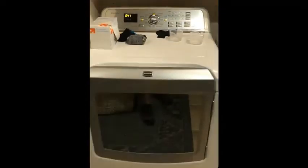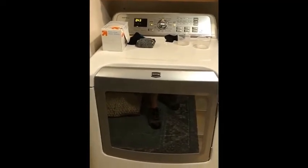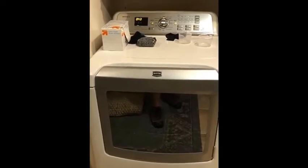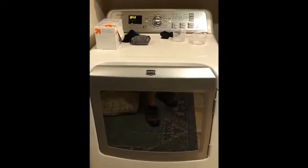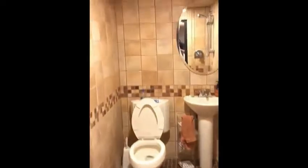Since windows and doors are closed, the question is where is that air coming in? Could running the dryer impact the operation of the water heater? Maybe — and that's what we're going to test for. I've turned on my dryer. Since we're doing what we call a worst-case or greatest depressurization test, I'm also going to turn on the bath fans.